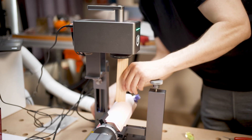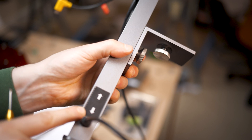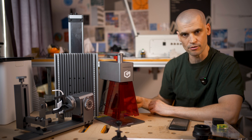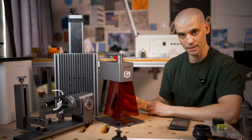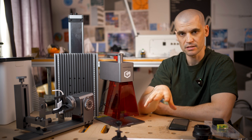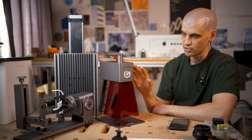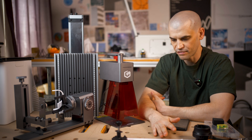Just a few other little annoying things. The controls to move the laser head up and down are just essentially a flat touch surface. The problem is that if you just reach behind it, you don't really know whereabouts it is and where the arrows are — it would have been nice to have some tactile feel so you know what is the up and down arrow. Another issue: I'm used to pressing start in the software and then coming over to the machine to manually confirm I want to start the job, but with this you literally just press start in Lightburn and the thing starts.